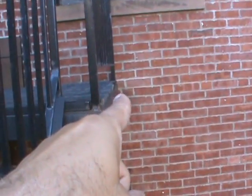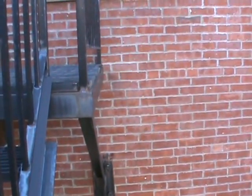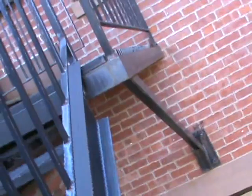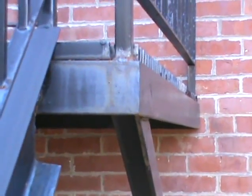Again, the quick fix here is that 4 to 6 inches away, right there, you're going to put a new through bolt epoxy bolt, so you don't have to go inside and disturb, no plate on the inside. And that epoxy bolt will basically now be a 3/4 epoxy bolt that will then pick up this corner, and this will be a proper bracket. This bracket is welded at the bottom, welded up here, it needs to be x-rayed or load tested, or I can give you an opinion that it looks good at this time, but I do see water intrusion getting in there, so if I do sign an affidavit on this, I want the liability disclaimer.